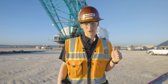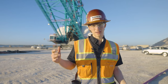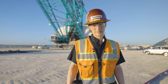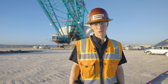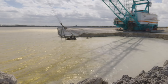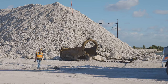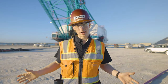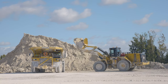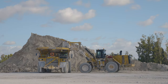Since Florida is full of water, you can't pump it out and dig a traditional quarry. Instead you basically just have to mine underwater. The method of choice for the big aggregate mines down here is using draglines. It'll take the material from underwater and flop it up top onto the surface — like that pile right there. The water will drain out over weeks, and then loaders — they use 992s and 988s here — will come in and load haul trucks from those piles that are above ground.